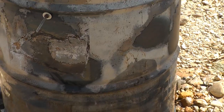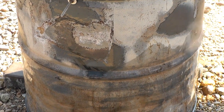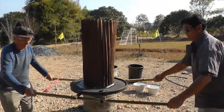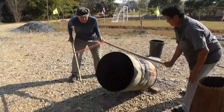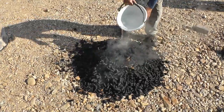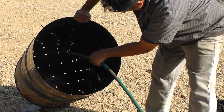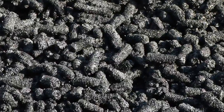How do you know when it's done? Toss drops of water on the side of the barrel. When you get instantaneous puffs of steam close to the bottom, it's ready to go. Lift the top off and put it far away. Pour lots of water on the hot char. When you think it's dead, dump it. Then pour lots more water on anything that steams. When you're all done, clean your barrel — it will serve you well for years to come. Good charring. And remember, waste feedstocks only.